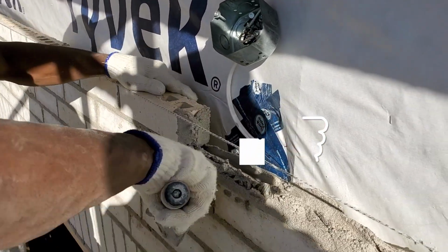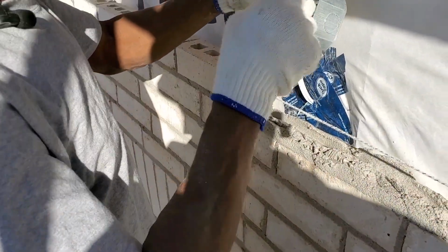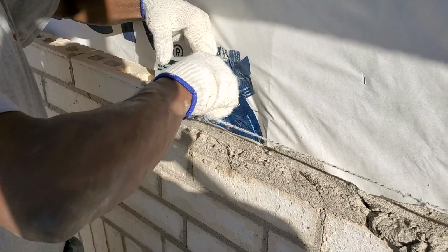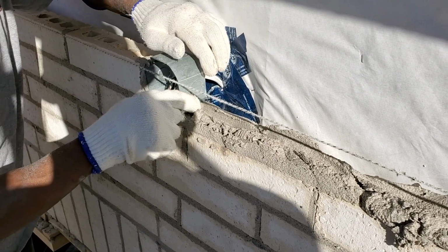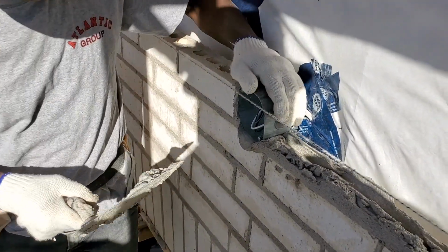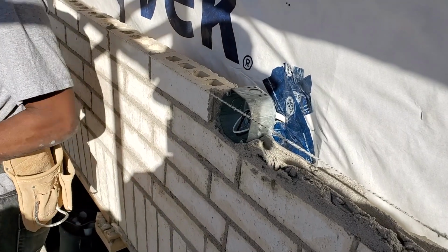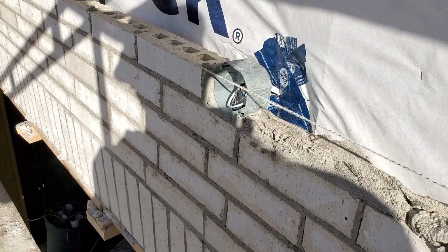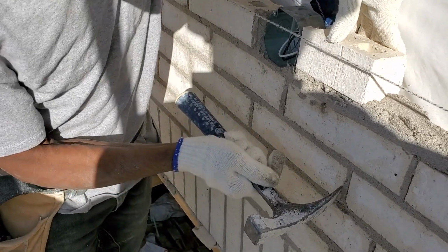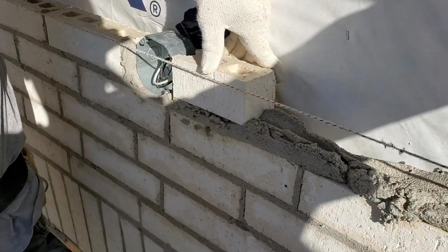Now it comes to another area where we're definitely going to be putting the light box again. So we've got 2 light boxes in this garage, and they're always placed in the center of the garage. It's 2 garages. We're going to be placing it in the center of each garage, right? Now, like I showed you before, you have to follow the band. So the band is here. You make sure you have a brick cut to reach the band so that when you start the next brick, you're lined up.